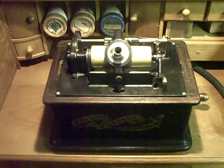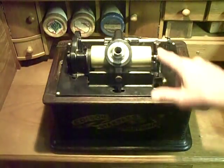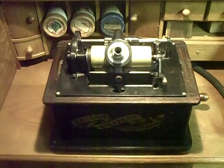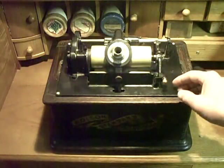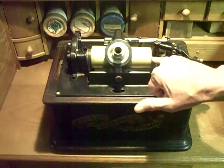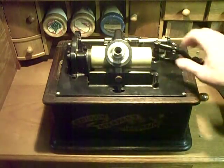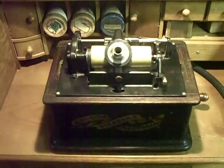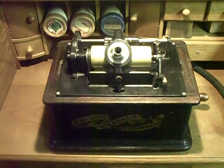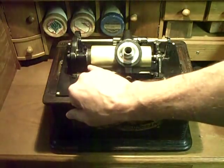This is a fairly simple machine, strictly two-minute. The reason I wanted to use a Standard B for a recorder is it has an end gate — I've used the D and I've used the Home. The nice thing about having an end gate is the mandrel is supported on both ends. There's a simple bearing here — a pointed hardened steel shaft that goes into a tapered hole. A few drops of oil on the carriage rod, a few drops on the mandrel shaft, and a few drops on the governor and friction pads, and this makes a really effective little recorder.